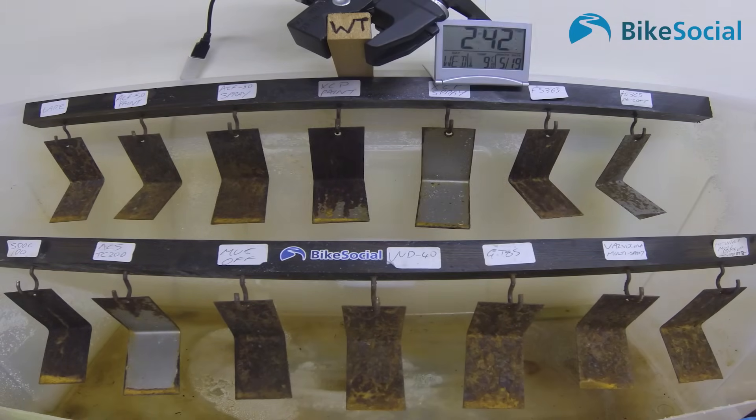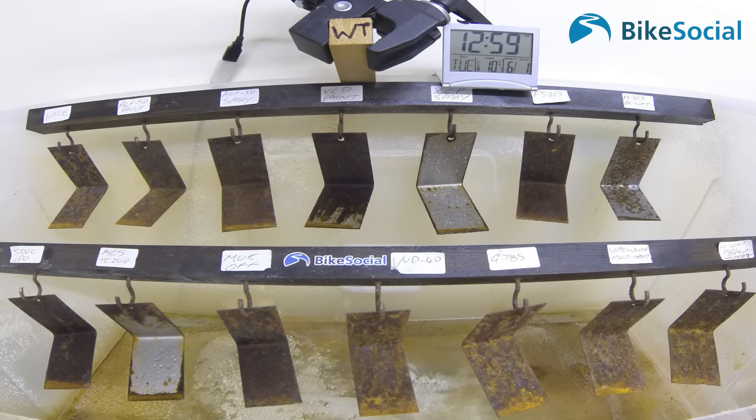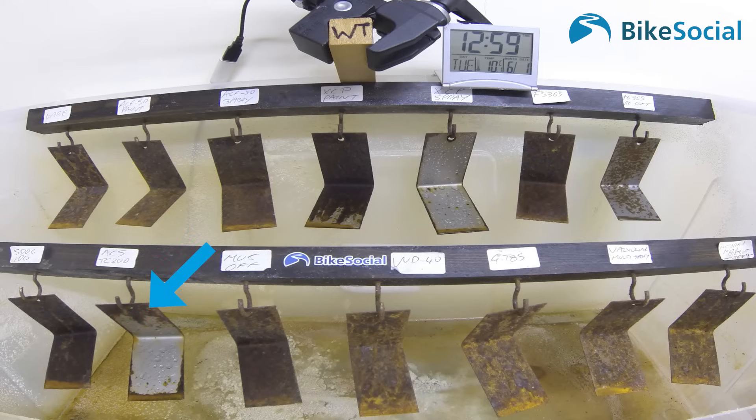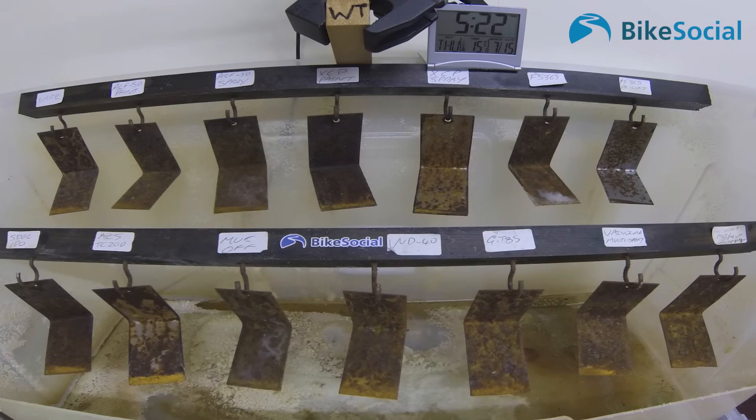From six months into seven months the GoPro was flashing but not recording, so we suddenly skip ahead. You've seen the whole test up to six months and one day. At that point the ACS TC200 has got a fair bit of corrosion, particularly on the vertical surfaces. The XCP spray has spots of corrosion and is going around the edges, but significantly less — both products have done incredibly well. We then skip ahead to seven months and 15-17 days, and you can see the XCP has a very significant amount of corrosion, and the ACS has even more.